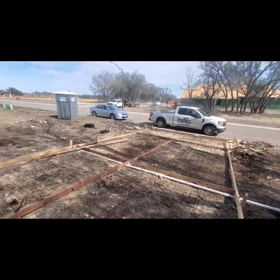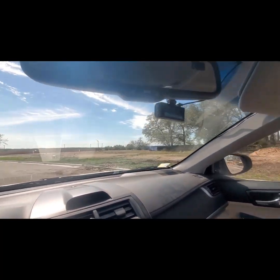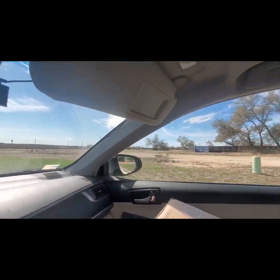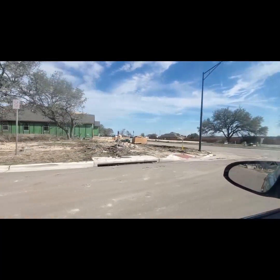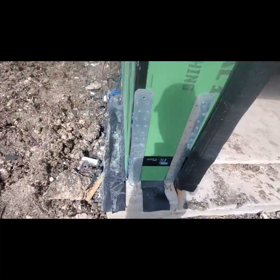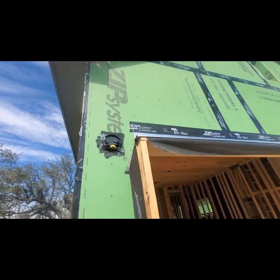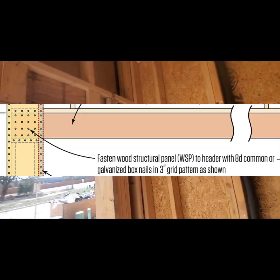Let's see what else we can find. They've got a lot of construction going on out here — in another year all this is going to be full of houses. Rocking up to this one, I'm seeing the exact same thing. Same builders, I guess. They've got the masonry flashing on the underside instead of above, and they're missing a whole bunch of nails at that hinge point corner.